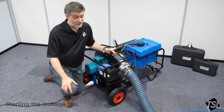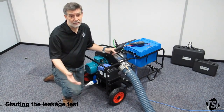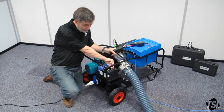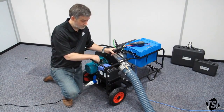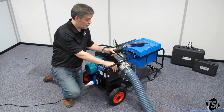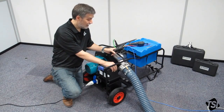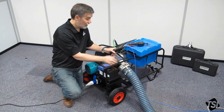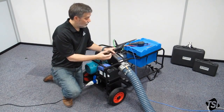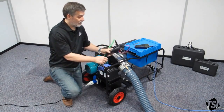We now have everything ready and set up for the test. To begin the test, you need to set up your test duct to 400 pascals, or the value that's been specified. Turn on the fan speed controller, turn it to the run position, and then wind it up. Watch the PVM610 and watch the values come up. As you get near your target, slow down — it can take some time to get a stable reading. Once you have a stable reading at 400 pascals, or whatever value you've chosen, we can then move over to the TA465P.